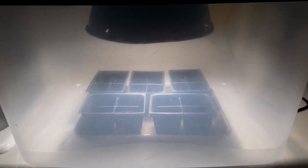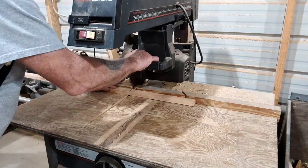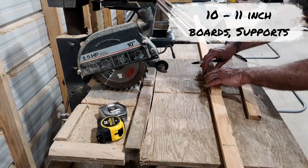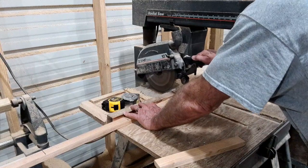I didn't like the idea of putting books and boards under my seedling containers to hold them up to the light — as the plant grows you have to keep removing things. So I came up with a different idea. There was some trial and error because I'm not exactly a mathematical genius. The stock I'm using is about one and a quarter inches wide and a half inch thick. I went to the radial arm saw and cut four twelve-and-a-half-inch boards and ten eleven-inch boards.